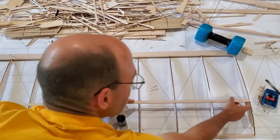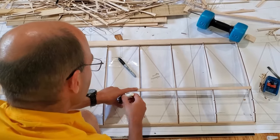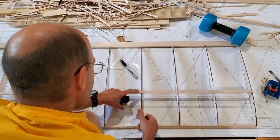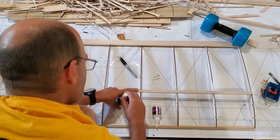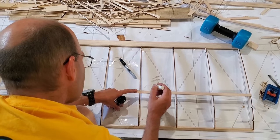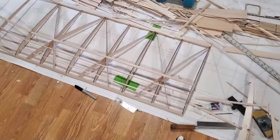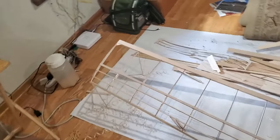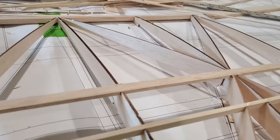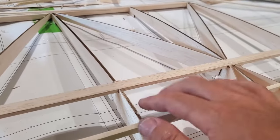This bar has a little bit of a twist to it, so it's not wanting to lay in quite right — may have to get a little more aggressive with it. We have the outer section here. We'll get all the spars installed on the top surface, diagonals, and so on. But first we have to install the lower ones, and before we can do that, we're going to have to put the shear webs in. That greatly strengthens the wing.